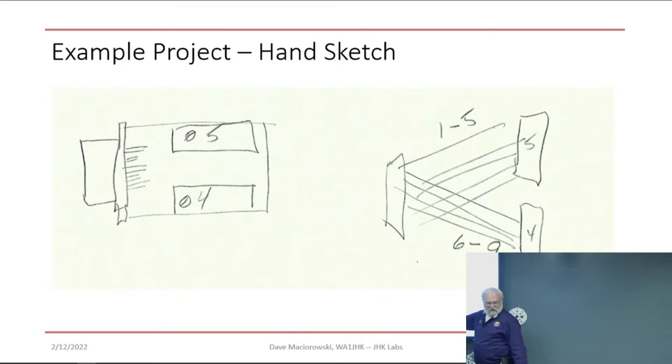On a DE-9 connector, the top row has five pins and the bottom row has four. I'm going to take the top row and put it on a five-terminal strip, and the bottom row on a four-terminal strip. When I lay it out, I'm going to lay it out similar to this product — the Chinese version from Electronics Salon.